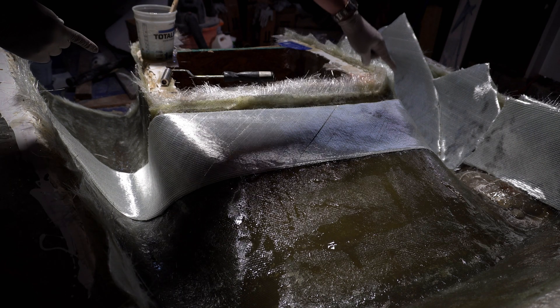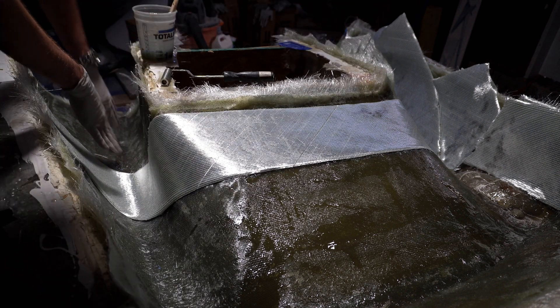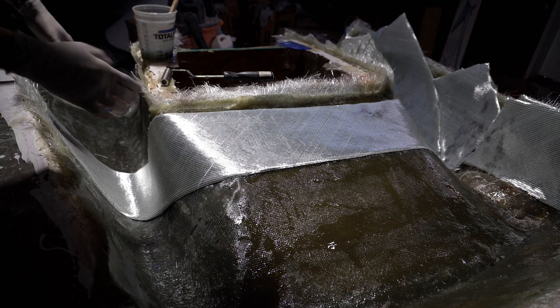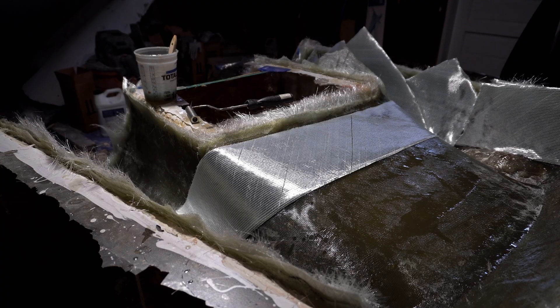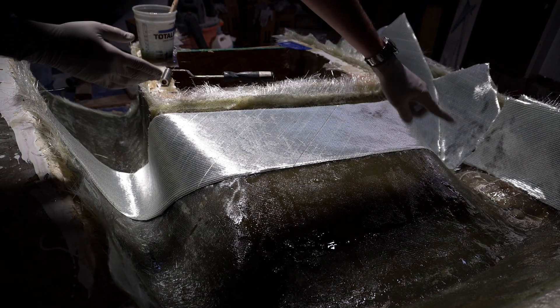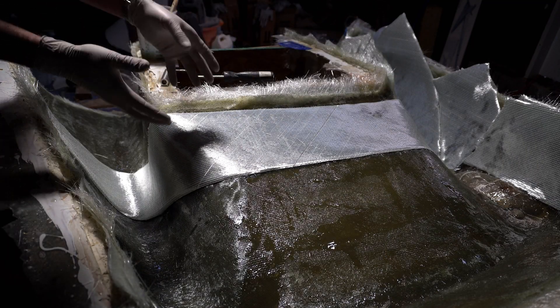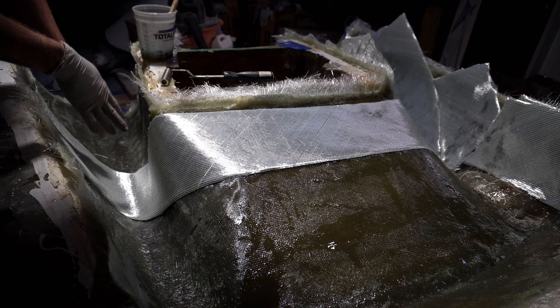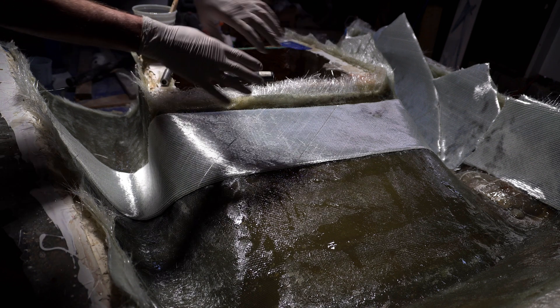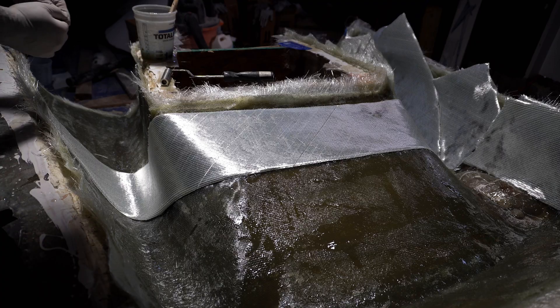This piece runs along, comes across the whole way, and then comes over to here — that's going to help to really tie the whole boat together back here. We're going to emphasize getting that piece in a couple of times in subsequent layers. The hawse pipe for the anchor roller kind of breaks up the ideal run of it, but we'll do our best to get it in as much as we can — at least over here — where it'll tie from one side of the hull all the way to the other. That'll really bring the whole piece together.